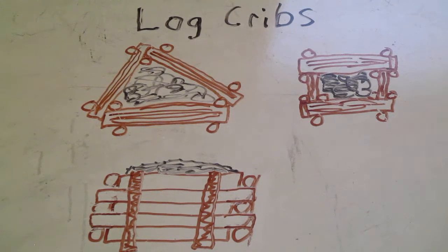We mark out our holes, roll the log out of the way, and start digging. This will be easier to put into dirt and gravel roadways than in asphalt or paved surfaces. If you're putting it in paved or asphalt roadways, you'll probably want to use shape charges to bust a hole in the asphalt, then go in with post hole diggers and shovels to get the right depth. In dirt and gravel roads, just go in with the post hole diggers, because shape charges will make too wide a hole and you'll end up having to put a lot of material back in.